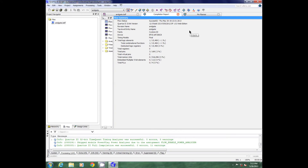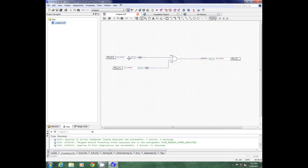The compilation has now turned my diagram, my drawing, into computer code ready to go onto the FPGA. But it's not on the FPGA yet — it has just been compiled into computer language. Now I want to upload that file onto the FPGA. I'm going to actually program or reconfigure the hardware of the FPGA, so I need to go to the programmer, right here — this button, programmer — and I'll click that.